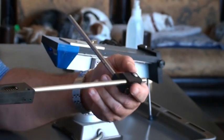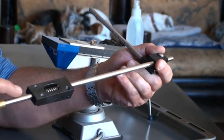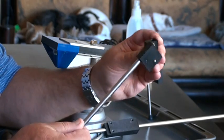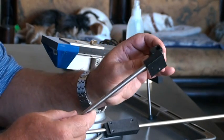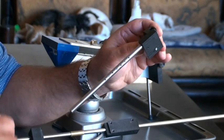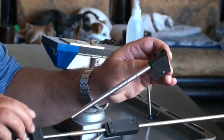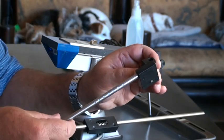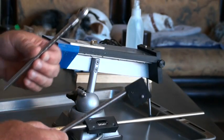That millimeter over here equates to more millimeter differences out on the back side. What I've done is modified this — or had a new one made — to give a 360-degree swivel with the angle box on. The old one gives very inaccurate edge contact down at the stone level, because when you exert pressure on the arm, that millimeter lift at the top means you do not contact the edge.